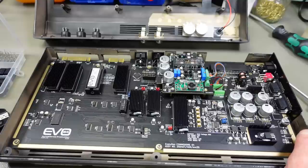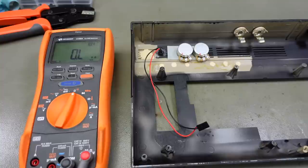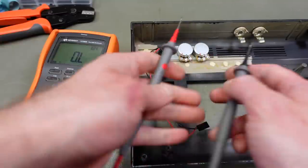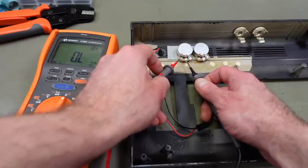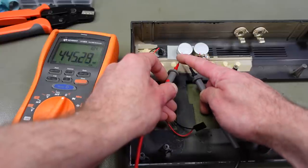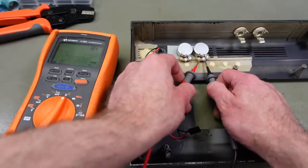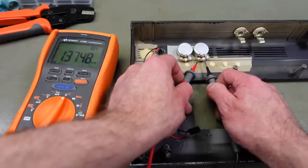Yeah, I think I want to start with wiring up the potentiometers. And these should be wired up in a way so that they have the highest resistance when turned all the way counterclockwise, which they are now. And I already determined that the left pin on these from this angle is the one that gives us the high resistance. And basically you have 3 pins on these.